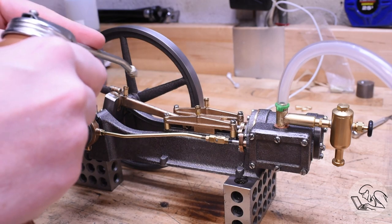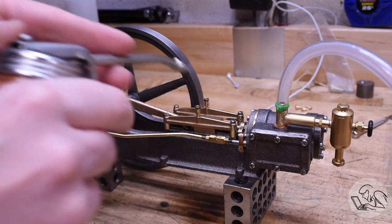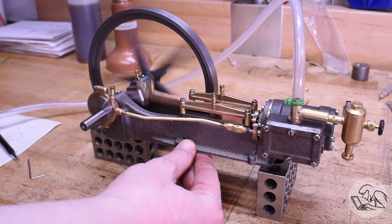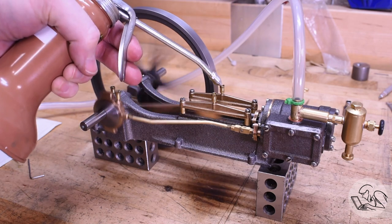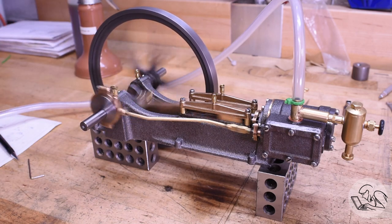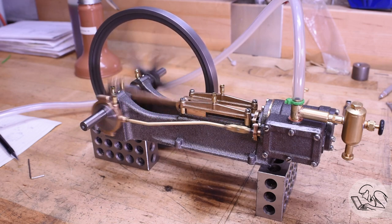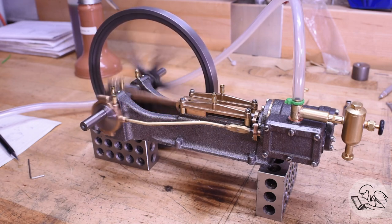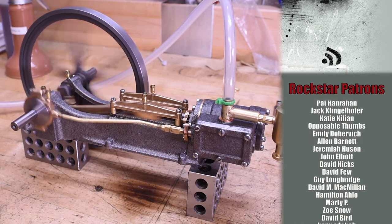Let's try out the system. I'm topping up all the oil cups with the pin bearing journal oil. I'm running on air so the lubricator is just going to be decorative here, and I've put oil inside the cylinder. If you're going to run on air you've got to get oil inside the cylinder somehow — pull the cylinder head off and inject some, or inject through the steam port and hope it finds its way in. Either way, don't run it too long on air without proper lubrication. That's working really well. The lubricators on the crosshead slides are a little bit heavy-handed — they drain out pretty fast because there's just a very short passage underneath them and the crosshead is pulling oil out of them every time it runs by. That's the only thing I might change — maybe make a smaller hole in those lubricators — but otherwise it's performing really well. Engine's running well. That's it for the lubrication system. Thank you very much for watching. I hope you enjoyed this segment. If you like what I'm doing here maybe throw me a little love on Patreon and I will see you next time.